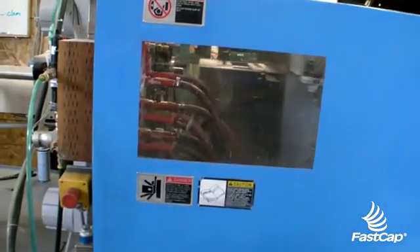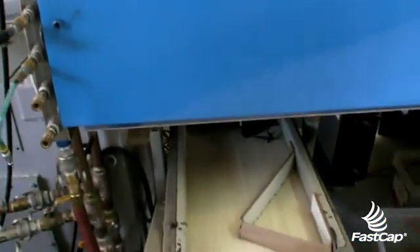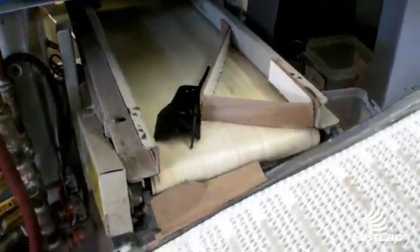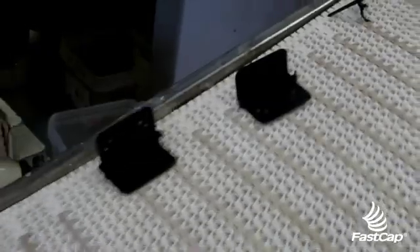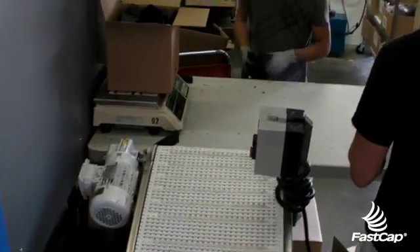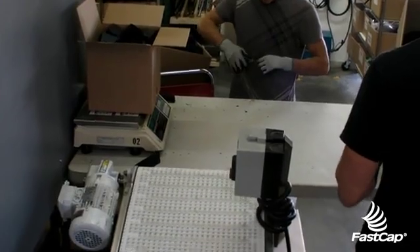We're back and we're at machine 6 — watch, the machine just opened up. Here come the parts. If you remember before they got dumped in a tray, now they're going down on this belt. Everything's coming down — the sprue, which is this piece right here, and the parts — they're all going up together on the second belt, where everything gets touched only once, everything gets clipped, and if it needs reworked, it gets reworked immediately.